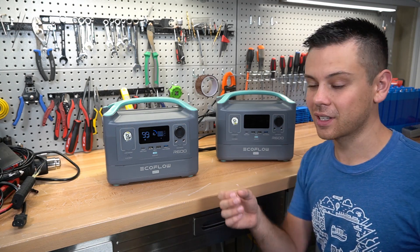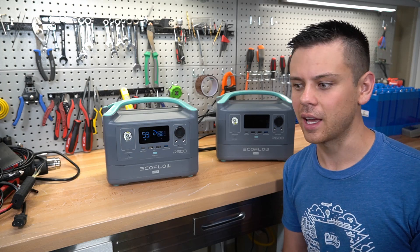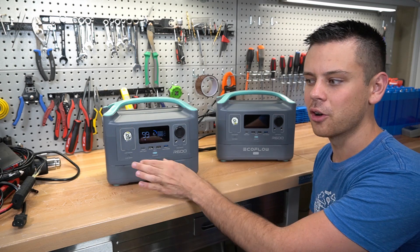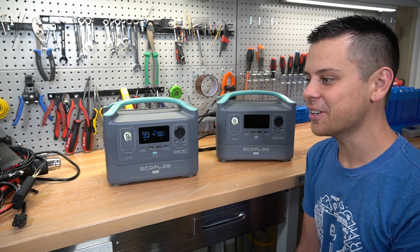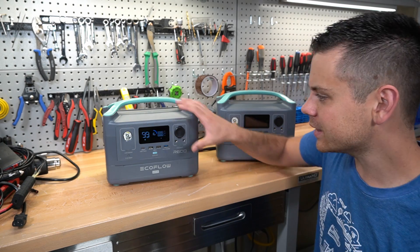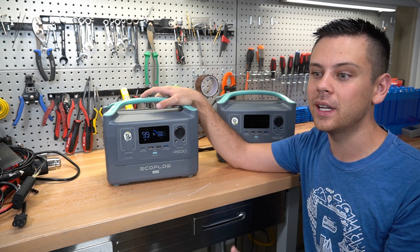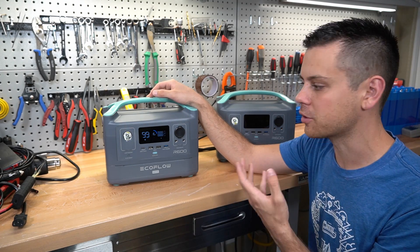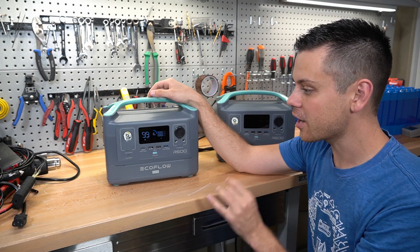I really hope they fix the UPS overload issue especially, because it shouldn't be doing that. The inverter is working better, but now we have temperature management issues and the UPS goes into overload when chained. I hope they fix that in the next update. I really don't want to make more videos like this where I'm constantly experimenting for multiple days. Just updating the firmware took two and a half hours, which was very frustrating.